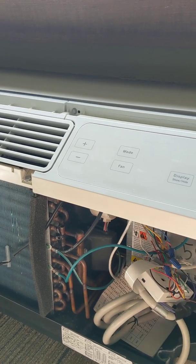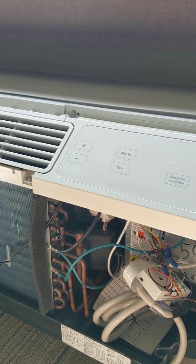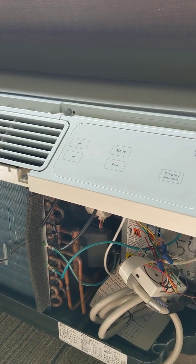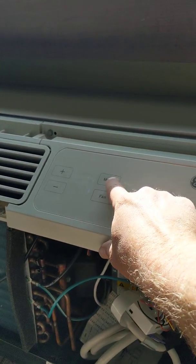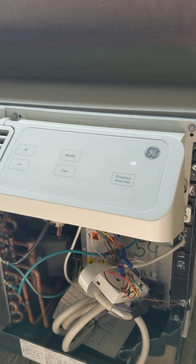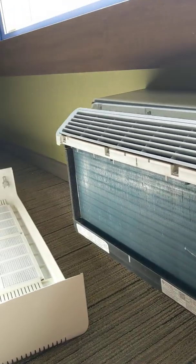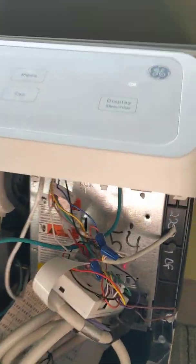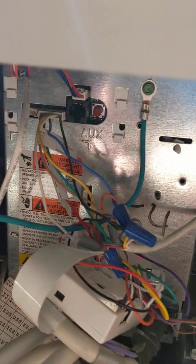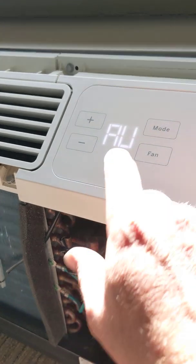The first thing you have to do is either turn off the air conditioning or heat or whatever you've got going on at the wall thermostat first. I've already got it set up to control from here, so you won't see that — I'm just going to shut this off real quick. So just go to off, wait for it to shut off. If you're still hooked up to the wall thermostat, do that part there, then come over here and go underneath and push the AUX button — that's the big red button down there — just like we did for the temperature cool limiting adjustment.